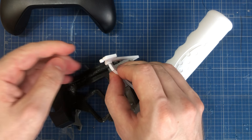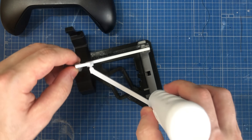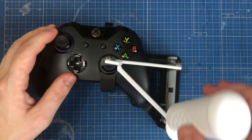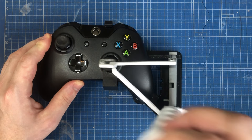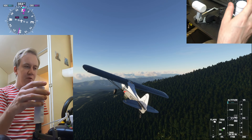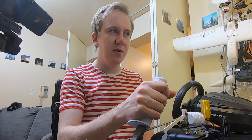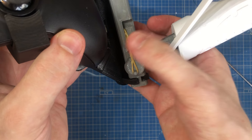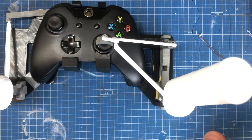You just take all these parts and click them together. You attach the base to your controller, then this shaft piece to your base. You snap these linkages together, and the stick holder goes here. The funny shape that they make ends up transmitting the geometry perfectly. If you want more centering force so that when you let go it returns to center, you can snake a rubber band through this special shape and it'll give you spring tension in two axes.